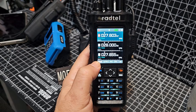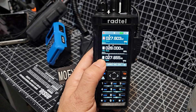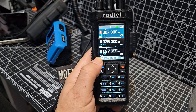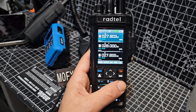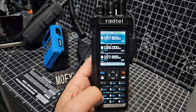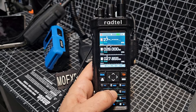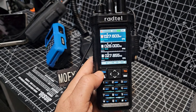AM — it will change to AM, and then if you go into HF mode, that opens up a whole new raft of frequencies on the Pro model, below 18 MHz. But this is just to answer that question. And now, in VFO mode — there's memory and VFO mode on these. In VFO you can just type the frequency — just go 27.6125. There you are, just type it in. Bye for now.